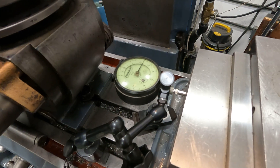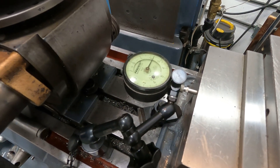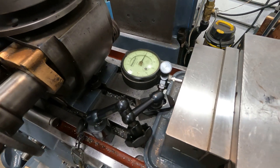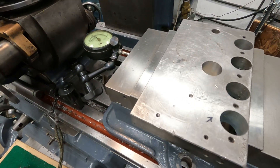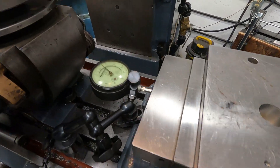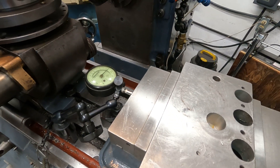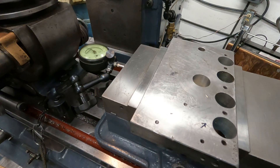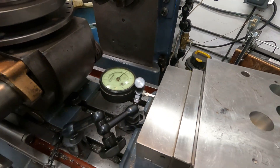What happened? We got two thousandths and three tenths of stretch. Let's pull it back — watch the rubber action of metal. Let's do it again and see if we can get two and a half thousandths of stretch out of this. As strong as I can — I did it.